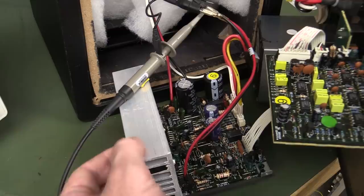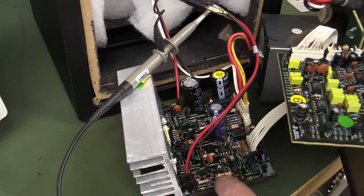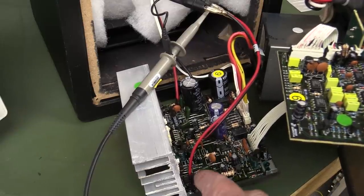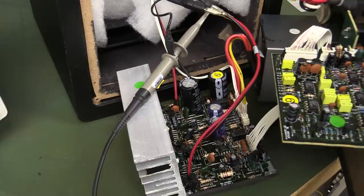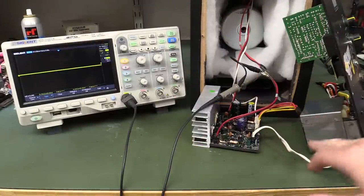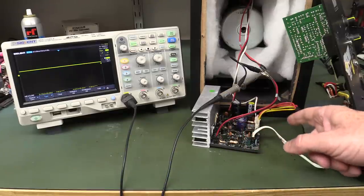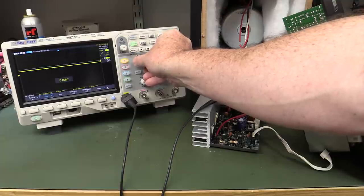So before I attack the circuit and try to reverse engineer it and figure out what chip it's using, I'm going to try and just clean up that conductive gunk. Because look — it's right on the output wire going to the positive output of the driver for the tweeter, and it's oscillating. I'll try to get in there and hopefully it dissolves off with some PCB cleaner. If we power it up without the preamp connected, we don't get the oscillation — but there is a DC offset on that output.